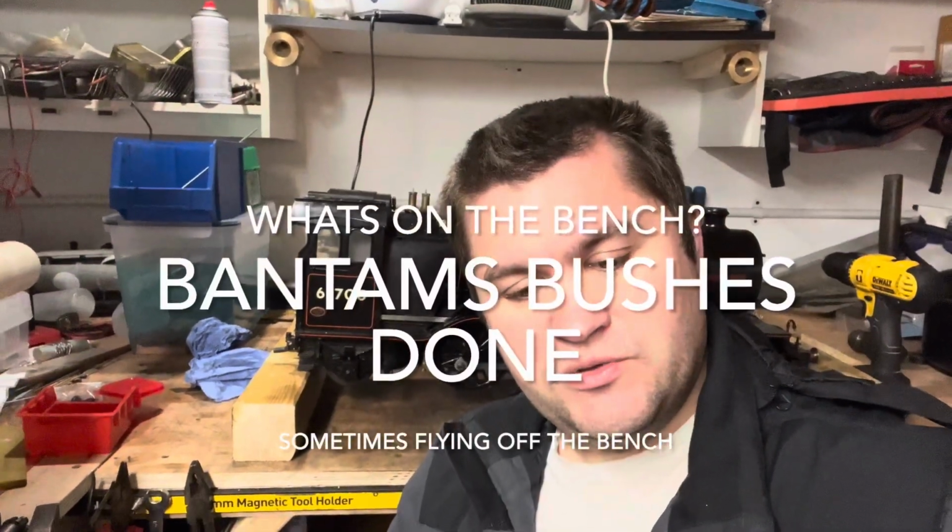It's been a while since you've been in the workshop. The work has been going on, but who wants to see me make bush after bush after bush after bush? Everyone knows how to make a bush. You drill it, you bore it, you skim the outside down and you part it off. Push fit in. Yeah, easy.